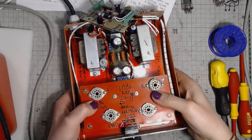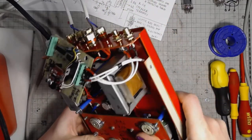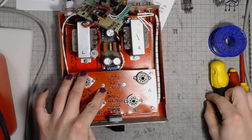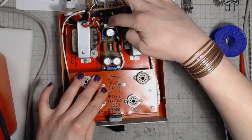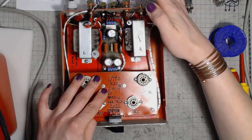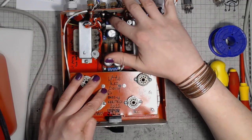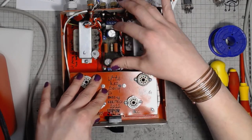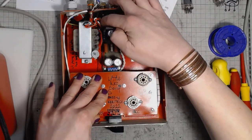So we've covered the amplifier part, the signal path, of course. The secondary windings of those transformers go to the binding posts, and the common ground binding posts are connected together and connected with the central ground point that is here.